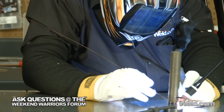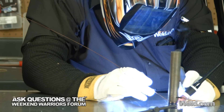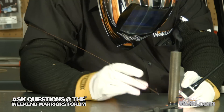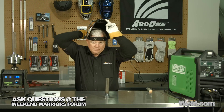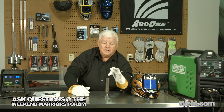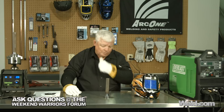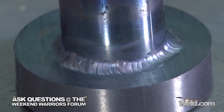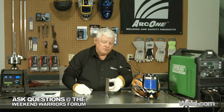When you get to your tack, you've got to slow down, let it absorb in real well. And if you do it right when you finish, you can't even tell where the tack is or was. Now that's welded up very nicely. If you have small quantities, the best thing to do is just set it on a table, maybe weight it down a little better. We have another little thing we call the other hand that puts pressure on here; otherwise it starts rocking on you. Overall, I had to turn it maybe five or six times to get it to do the 360-degree weld. If you've got small quantities, just turn it by hand — that's okay. The results are good. You could see heat build up as you go around; as the heat would come up, you'd see it wet out much nicer. Mild steel, you don't have to preheat it. Using a 1/16th tungsten — that's all you need for something like this.